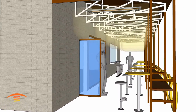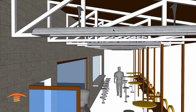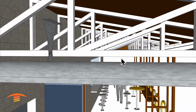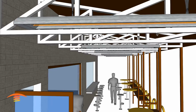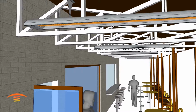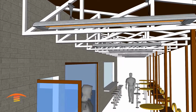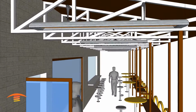And then let's just speak of that real quick. Not so much the clearance, because this is all steel frame, but the reason that we're using electric is because there's a few things. Number one, being at a beach community, it tends to be a little bit windier. Gas heaters tend to blow around the flame, and so their efficiency isn't as strong as it would be if it was these electrics, where there's no effect from wind as far as their output.